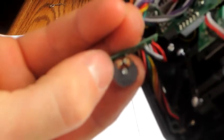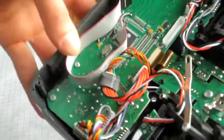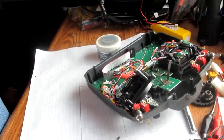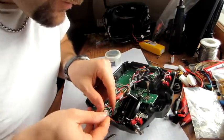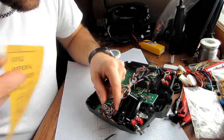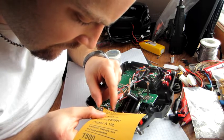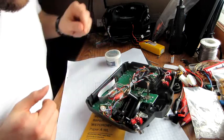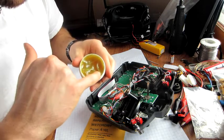The two bottom pins have the conductive paint on them. When it's still soft — a couple of minutes after you've painted it on — you can use the end of a Q-tip to clean it up. You don't want it too far up both sides because it is very conductive and it'll decrease your resistance. If you get any extra on the carbon film, very very gently scrub it and it'll come off. A little bit won't matter — just don't get too much on. The center pin has a good connection so I'm not going to mess with that one.